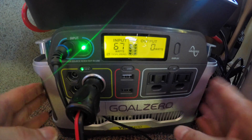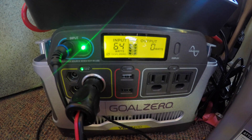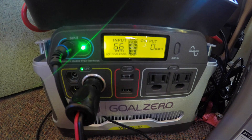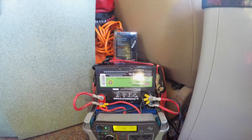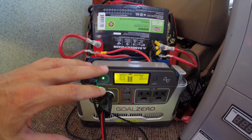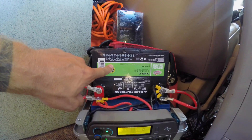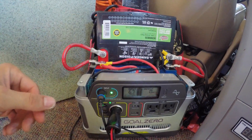When I originally got this I thought the 400-watt Yeti would be enough — it wasn't, mainly because of the large refrigerator. Goal Zero makes a really large Yeti and a smaller one; the large one was too big and over a thousand dollars. I could have daisy-chained two of these 400s together but that was also pricey. So I Frankenstein'd it and attached an additional 35 amp-hour battery — equivalent to what's already inside — doubling the system from 400 to 800 watts. That battery cost me $100 and the cables were about $5, compared to the $460 for the Goal Zero unit.